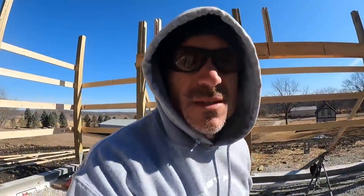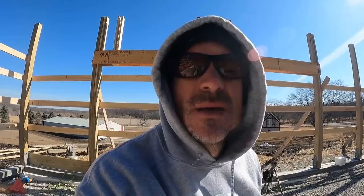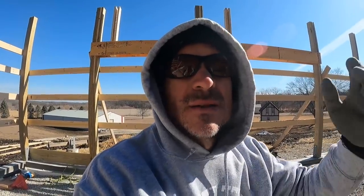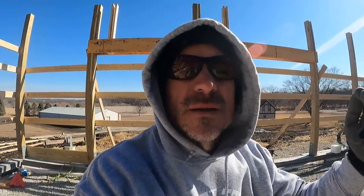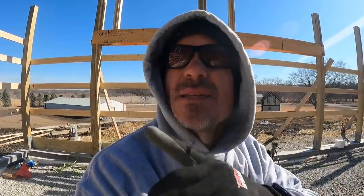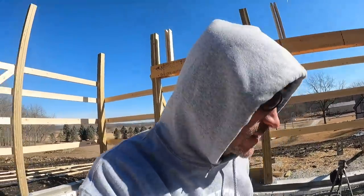And one thing different about this that you've never seen us do is we're doing dropped. This building calls for dropped purlins, and I'll explain that when we get to it. The end truss actually sits 3.5 inches lower than the rest of the commons, and that way there'll be hangers on the commons, and then you will obtain your overhang by going past the end truss because it's 3.5 inches lower. It'll get purlin nailed down through it. And then this has 18 inch overhang, so we'll go, let's see, 16.5 inches past. 2x fascia board gives us our 18.